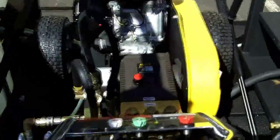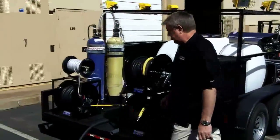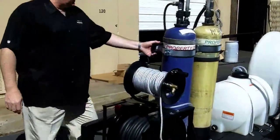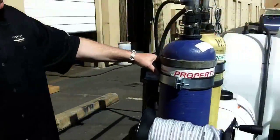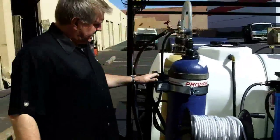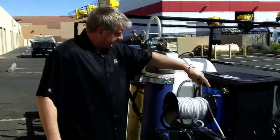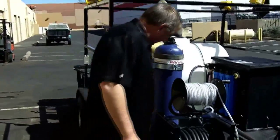They do a very nice job. You can see the size of that pump on the cold water — that's not a system you're going to find at a Home Depot or Lowe's. Four hose reels. The DI tanks over here — I have that frame built and then powder coated, and we use some brackets from a welding supply that lock the whole system in. It's got a plate, easy to access — built so you can get in and switch out the tanks. Works out beautifully.